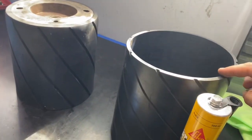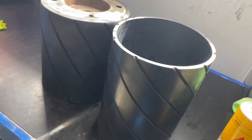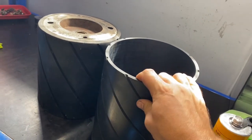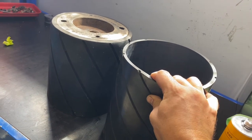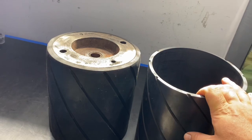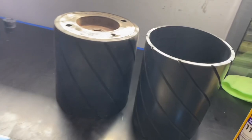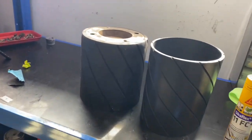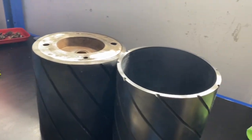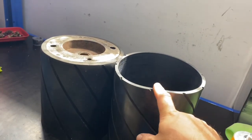That's half the cost of the vulcanizing. It'll be interesting to see what sort of longevity you get out of the slip-on sleeves because these aren't as tested — they should work but this isn't something that's been around for years that we know is going to work forever. If you're looking to do something right the first time, you can't go wrong with vulcanizing. But if you want to save costs and do it yourself, this might be your option.